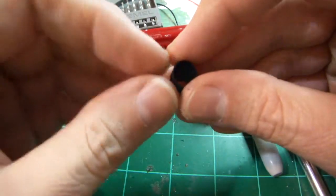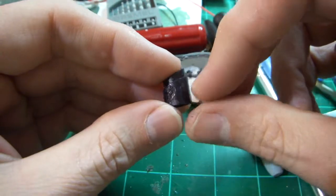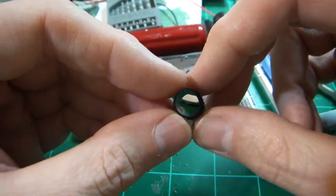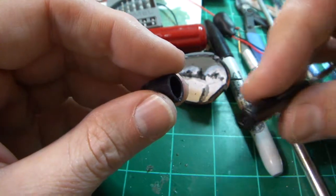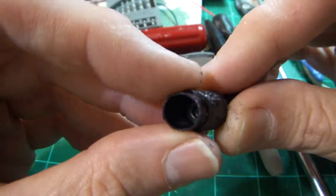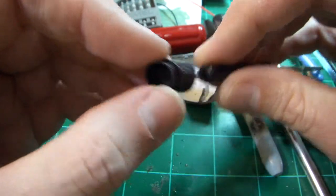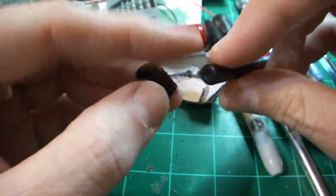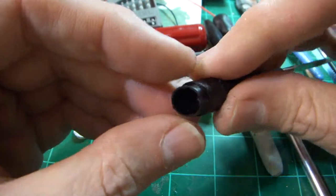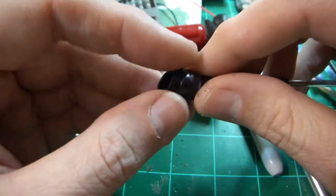Okay, I've got my piece done here, and the next issue is to tape off the back, fill it full of some dental acrylic, probably a certain way up. But I really don't want the dental acrylic all the way at the base, I don't think. So I'm going to take one of my diamond files that almost fits in here perfectly, and use it to raise the back up to where I want the dental acrylic. I'm going to put a little tape around here so it'll wedge in there nicely and tight, and put a little release adhesive, a lubricant like Vaseline or something, just a little brush of a lubricant on that, and I'm going to put that in place, and hopefully that will give me a good little platform to put my dental acrylic on really quick and let that set up.